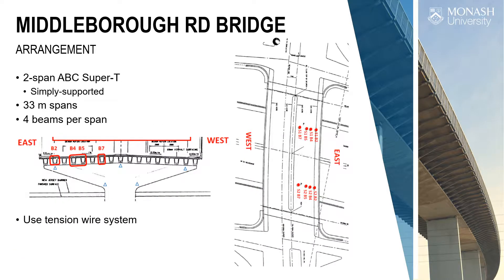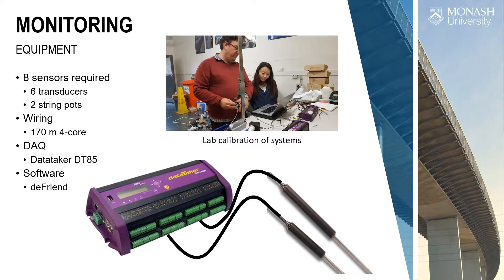The monitoring points VicRoads wanted included the pier shape, which is really problematic in terms of eccentric large loads. Some static monitoring was done by surveyors to make sure the whole thing wasn't tilting. We only had to monitor the beams — four beams on two spans of 33 metres. The 33-metre tension wire system scaled up all the problems we'd already seen on the 27-metre version.